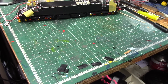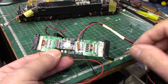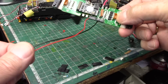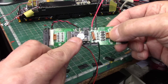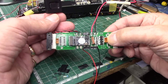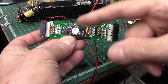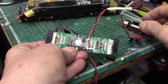You might not believe this, but this is my homemade tester. It's a PCB board from a Bachmann Class 66. Soldered to it are the motor wires, and I've got the motor attached by crocodile clips to those wires. The other side goes with crocodile clips onto the track to get power. It's got a Class 68 ESU LokSound chip - 21 pin - and I've even soldered a speaker to it. Because it's a Class 66 board it has lights fitted, so when I test I can check lights, check sound, and if a motor's attached I can check the motor.